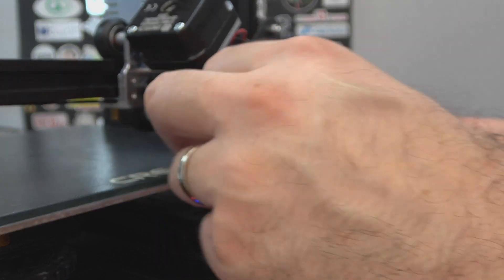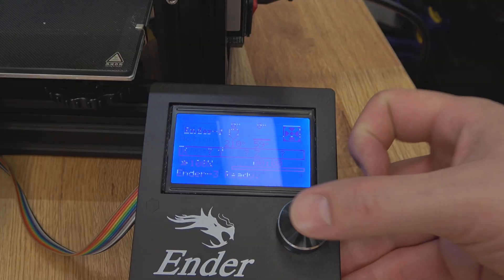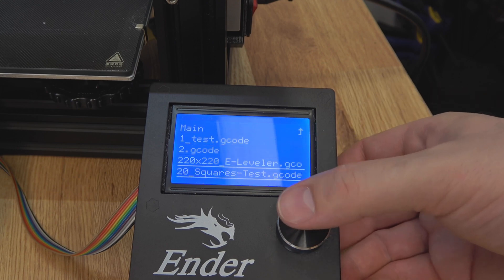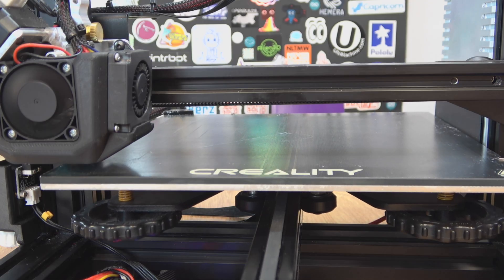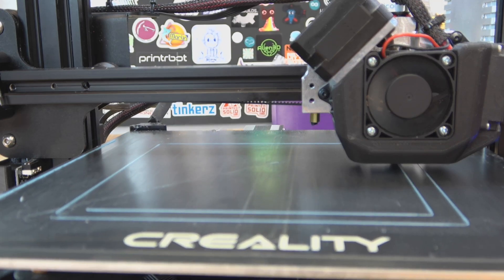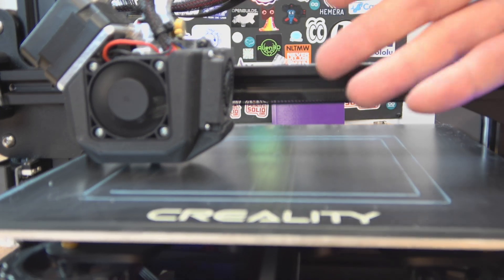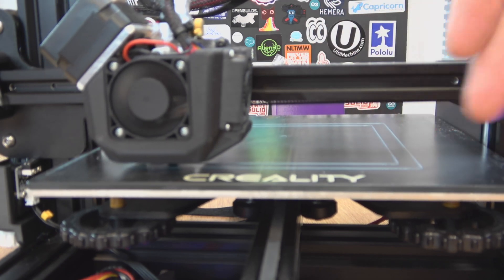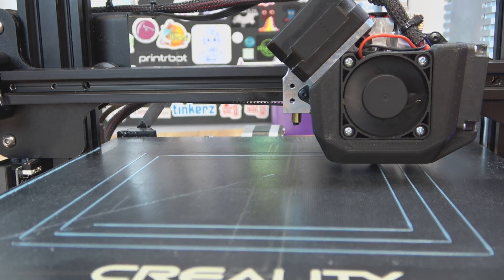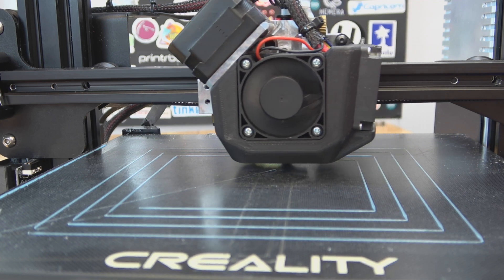And then you're level. From here, we'll preheat and get loaded up with some PLA, then run that second G-code. Filament's loaded, so we can kick off Chuck's square bed test and hopefully have the perfect first layer. We get a tone before the test starts, it does the traditional Cura prime line on the left, and the first layer is looking pretty good. You can tell this G-code was written for an original Ender 3 because it does huge retracts, and I have direct drive here, so it's not doing so well in the corners — but that's really not the point. We're just checking out what the first layer looks like, and it's going down nice and smooth.